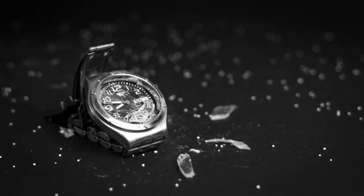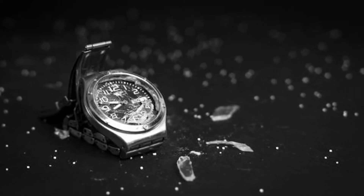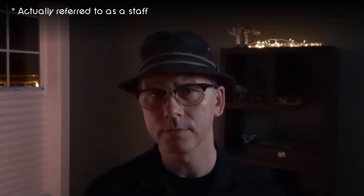When a watch is worn in a pocket, it never really gets knocked around being so close to the body. However, when a watch is worn on the wrist, it's really easy to bump it into something. And being smaller, they're actually easier to drop. When either of these events occurred, it was very likely that the watch was going to break, mainly due to the amazingly small posts on the balance wheel. These posts are so small because the balance wheel needs to be able to spin freely with as little friction as absolutely possible. So to accomplish this, the large weighted balance wheel is held in place by two extremely thin posts — one above and one below the wheel.